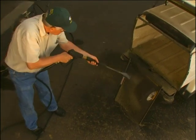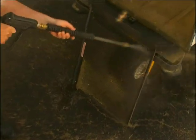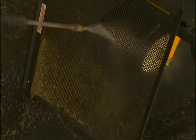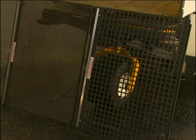Keeping the catcher exhaust screen clean and open is essential to good performance of the catching system. In some mowing conditions, for example wet and dirty, it will be necessary to clean the screen frequently to avoid clogging the mower deck, blower, and chutes due to airflow restriction. For improved performance in wet conditions, an optional exhaust screen with larger holes is available.